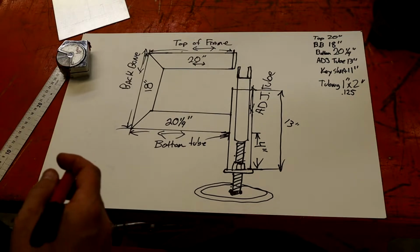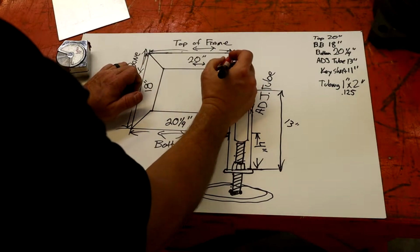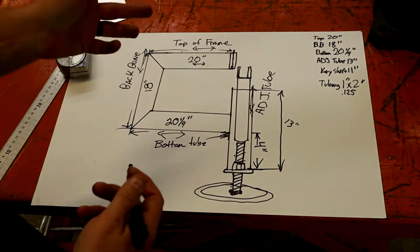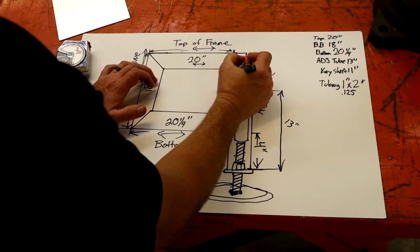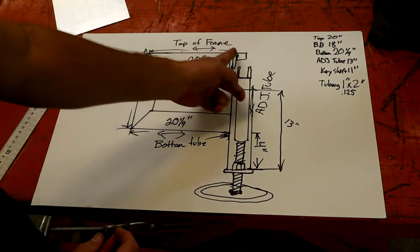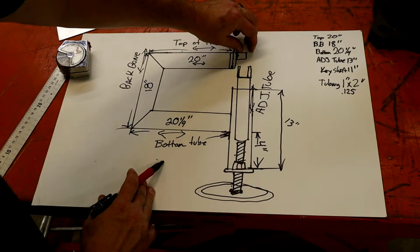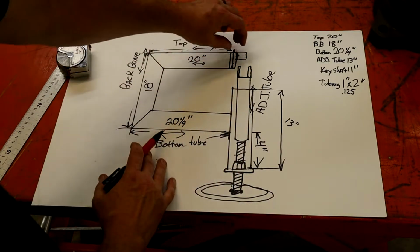What you have is, I think I had a 7/8 inch square stock, solid square stock. We just put it up in here and TIG it. It probably sits, kind of goes back in the tubing about that much. Then you just weld it on, and what I did was I used my key shaft that I had left over for this. And what you do is you mount your upper bearing on. So you'll TIG this on, and that's welded on. Just make sure everything's good square. This time you want to make sure everything squares up real good. You TIG it on because the bearing that goes on this has a set screw. So the cool thing is you can slide it on this and set screw, and you can align it. So you got alignment here in case you don't get everything perfect, which mine's nowhere near perfect, but you got that.